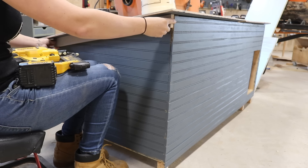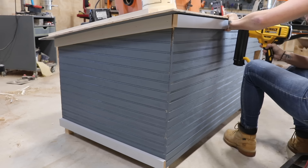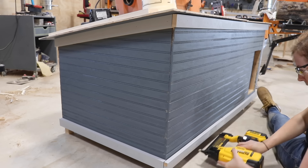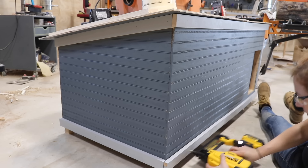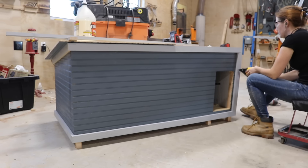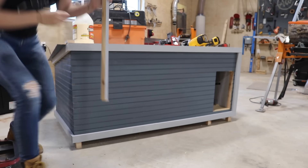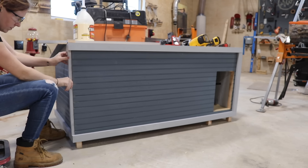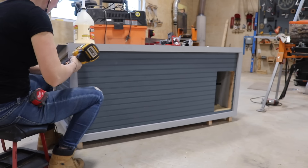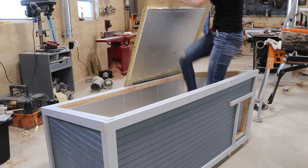While that was setting up to dry I started working on the trim. I ripped down my one-by boards that I'd painted earlier and started cutting them to length and attaching them. Glue doesn't stick very well to painted surfaces, so learn from my mistake — leave the top edge of your body unpainted to give a clean surface to glue to. I started on the edges of the house so that the front and back trim would cover up the end grain of the side trim. I also always cheat on trim: instead of measuring and cutting, I typically just hold the board in place and mark the back side — it's quick and comes out perfect every time.